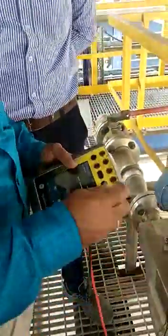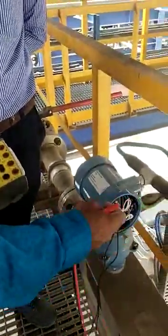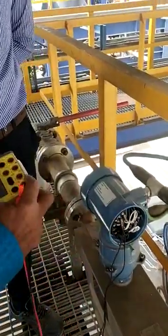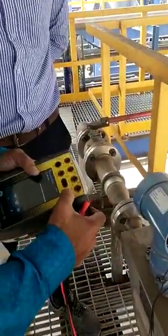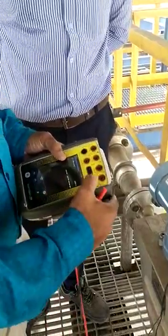Once you connect it here while connecting in the field — we already have 2 terminating resistors inbuilt in the loop and power supply is already going. So we have to give only these two terminals, which is non-powered. It doesn't have HART resistors, so you can switch it off here. It is non-powered.